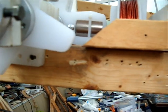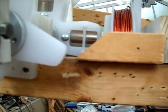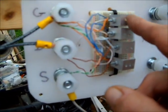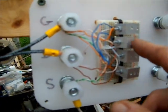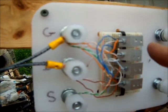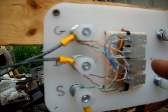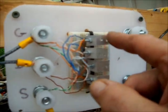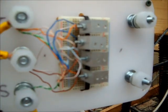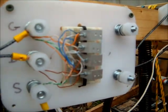That gives you about 12 amps at 12 volts. The MOSFETs are only rated at 125 watts, so I stuck four of them in parallel because I was tired of burning them up. We attached little homemade heat sinks to each one with a bit of thermal compound.